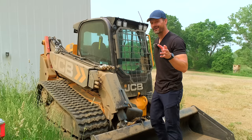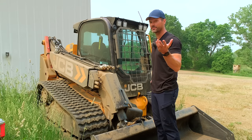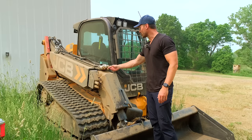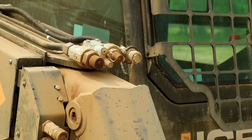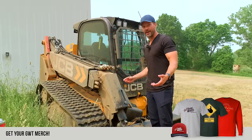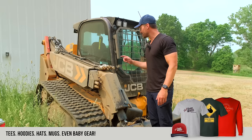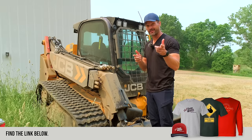Really quick one for you — and honestly, I've never seen this on a tractor, but it definitely could be on there at some point. This is a relief valve. You can pull that to relieve the built-up pressure in there. If your hydraulics happen to have a little handy pull tab like that, give it a yank when you're trying to disconnect things or plug things back in, and it could relieve that built-up pressure and make life a lot easier. Something I wish all hydraulics had.